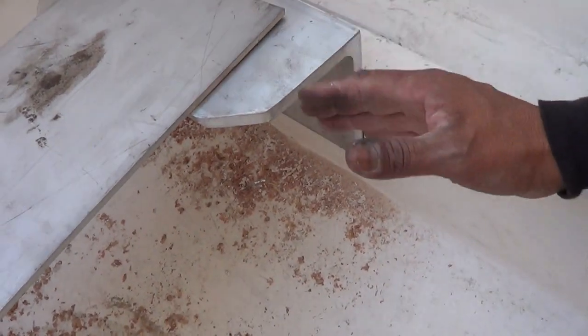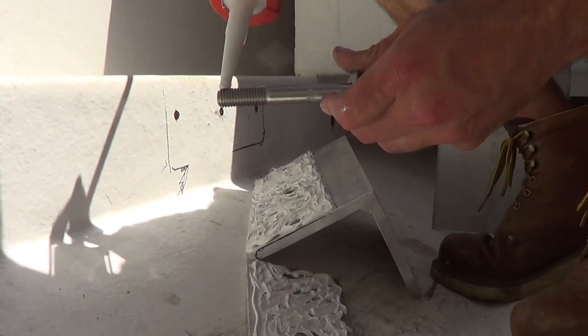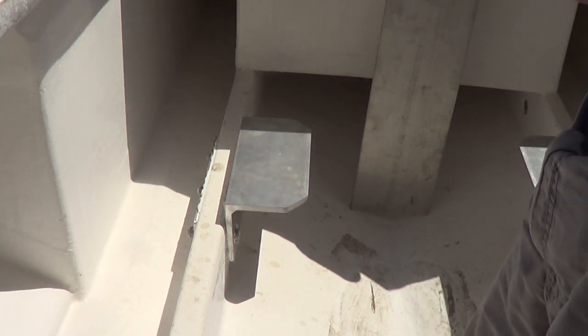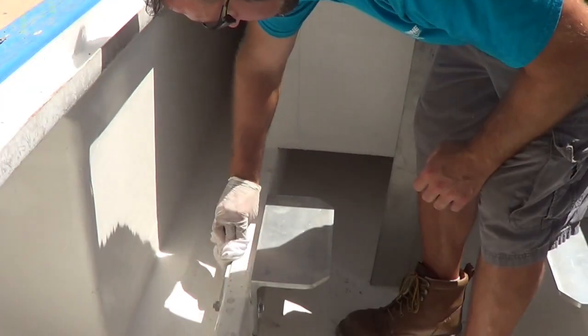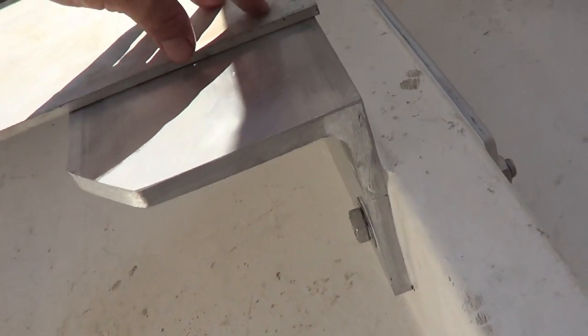The next step is to get everything down and put it in with M65 glue. When I'm setting stuff in the caulking like this, I tighten it up, let it sit for a few minutes at least, and then re-tighten it - sometimes the caulking squishes out between the surfaces. There it is, all done. They're set in M65, pretty flat across the bottom. There's a tiny gap - maybe a sixteenth of an inch in six inches - but well within the tolerance of what the isolators can make up. We're all good to go.